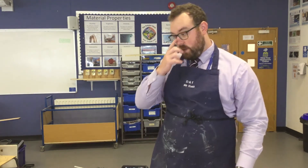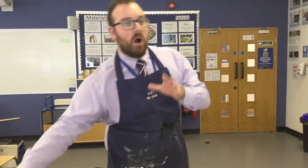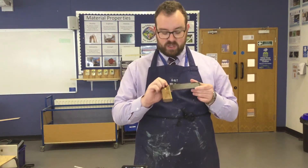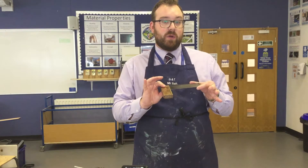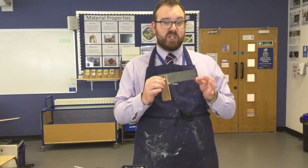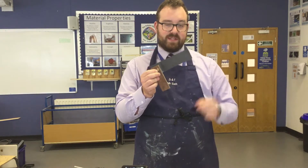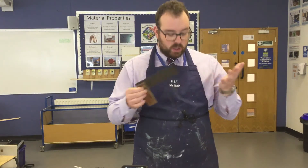The first thing I'm going to use is a really basic tool — this is literally the bread and butter of carpentry. The most important tool is your tri-square. A tri-square is an angle measuring tool; it allows us to mark, measure, and check that things are 90 degrees. This here is a perfect 90 degree angle.